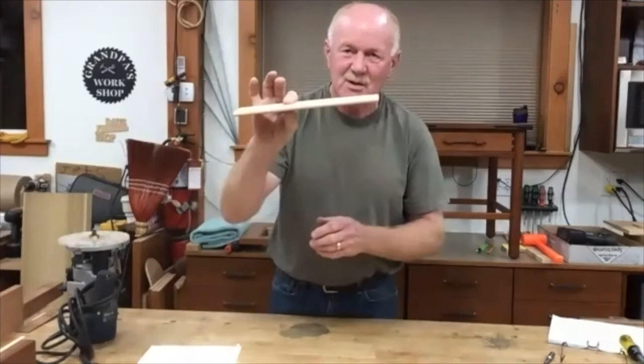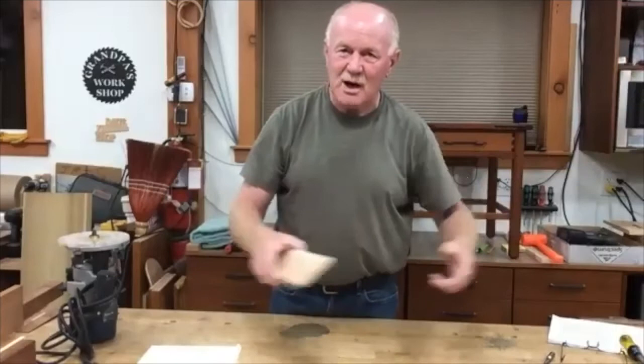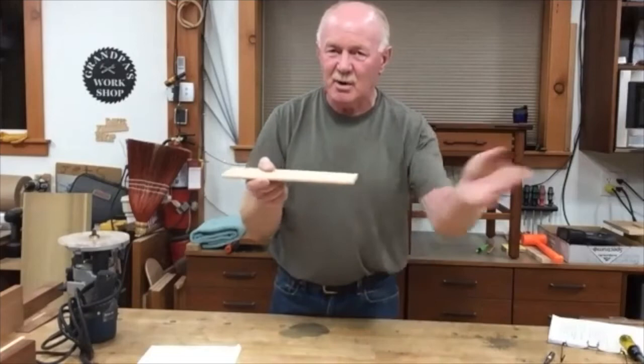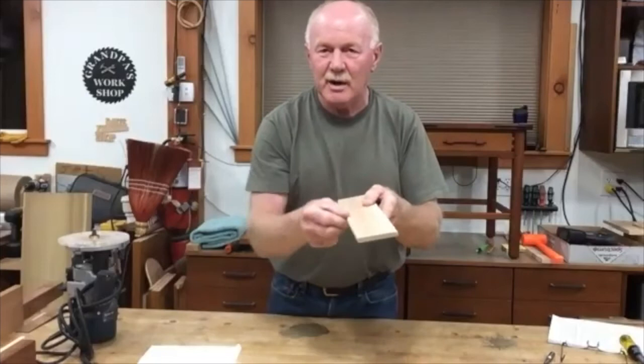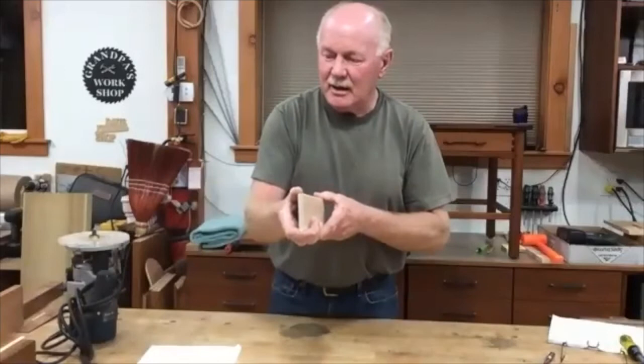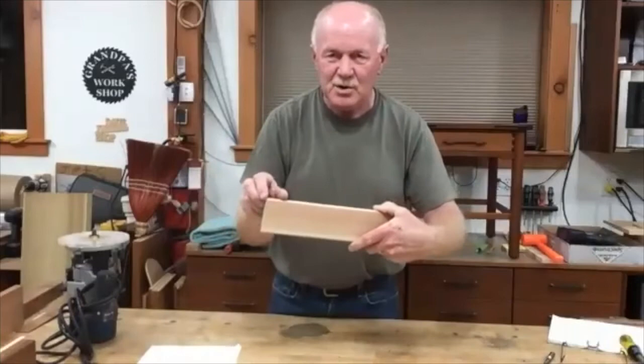So I've got my old 10-inch Ryobi lunchbox planer that I got 25-30 years ago, because it has rubber feed rollers. I can take that a thousandth at a time and dial in, or I can take it to my drum sander and get this exactly where it needs to be. Then you take it to a router table and put the radius on the two edges, because the router is going to leave rounded ends on your mortises. So I'll put rounded ends on my tenon stock and then cut them to length based on the depth of the mortises you did.